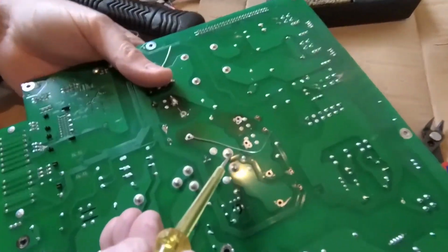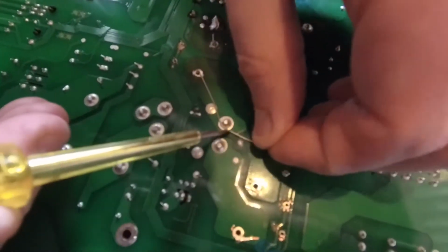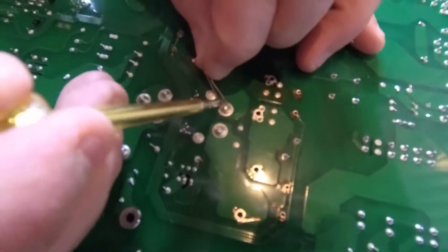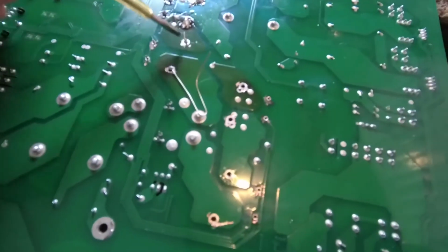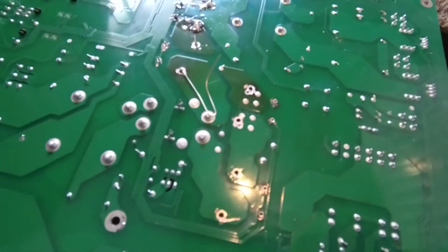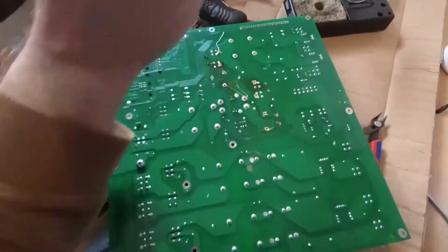This track ends up connected here. So what we'll do in this instance, we will actually make a connection point around here like that, and that will sort us out really well for this relay, and that's going to help a great deal. We're also going to solder this one, and that's going to improve the conductivity onto these pads. So very much like before, solder in second relay.